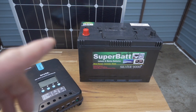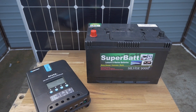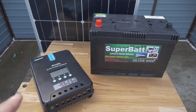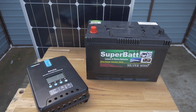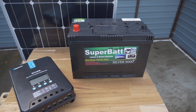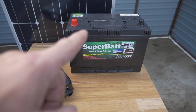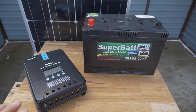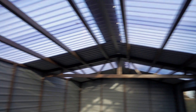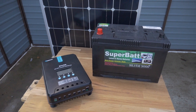So what I'm going to do first of all is show you how to rig these units up, prove to you that the panel works in the sunshine, rig the battery up to the MPPT controller, then rig the solar panel to the MPPT controller, and then prove that that's all charging. So the solar panel will go through the MPPT controller and it will charge up the battery. And then off this MPPT controller I can run some LED lights into our shed, so we'll have some light in here this evening. Let's get rigging.